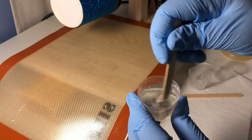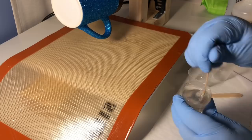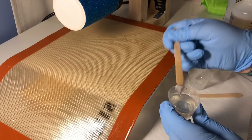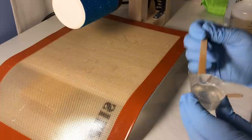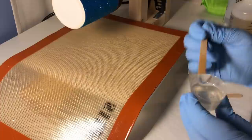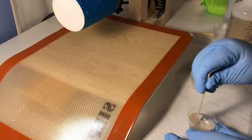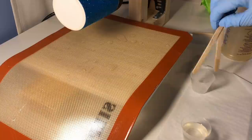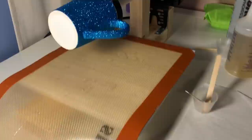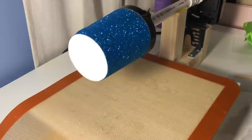You can see it getting fairly clear with not too much cloudiness left. Once I get it completely clear I pour it into a final cup, just in case there's any leftover unmixed epoxy on that first cup. If parts of your cup come out sticky or tacky and don't cure, that's probably because some portions weren't mixed well enough or you were scraping unmixed epoxy from the side.